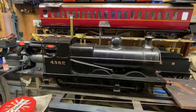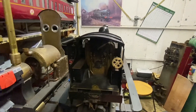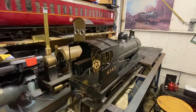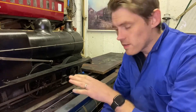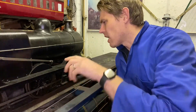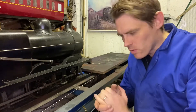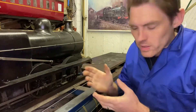There are a couple of known issues. One of the injectors isn't working, but I've got a couple of theories on that — we'll deal with that afterwards because it's going to come apart for painting anyway. The other issue is the crank axle has a slight wobble from one end to the other, and one of the eccentrics has a tendency to slip a little bit. Once we've got all the boiler and plate work off, I'll look at getting that driving axle out. It might be fixable with what's there, or it might need a new crank axle.